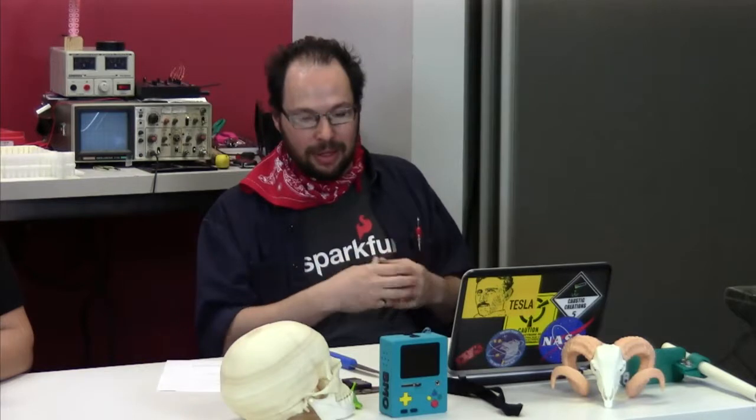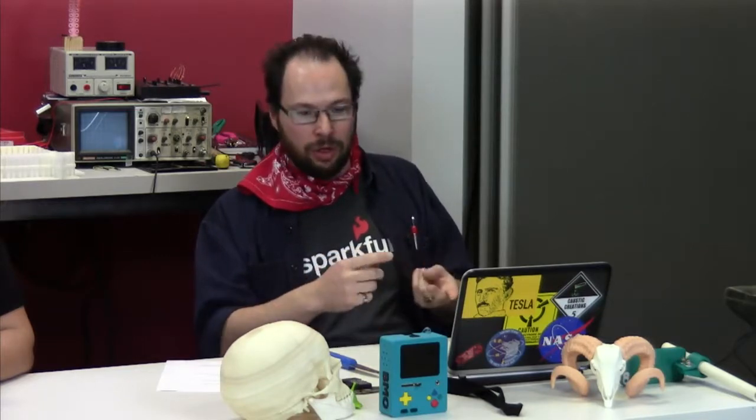Now, bare glass is usable, however, not recommended, and as much as I like to say I avoid warranties, printing on a bare glass surface will void your warranty, and it will, not if, it will chip the bed eventually. Even if you use surface treatments such as acetone with ABS dissolved into it, or glue stick. Yeah, just regular stick of glue. You might want to have something in between that and the glass.